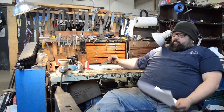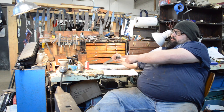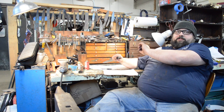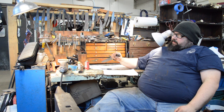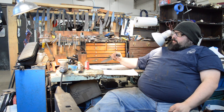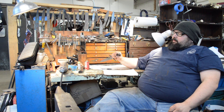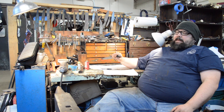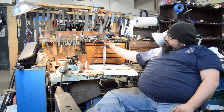After the knife was fully assembled and glued up, I dropped some epoxy in the hole, pressed the stone in, then came around the outside of the bezel with a punch and upset the bezel into the steel — evening it up, polishing it with a hammer, and really binding it down. It's never going to come apart. If this knife ever needs to be disassembled, I honestly don't know how I'd do it.